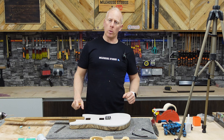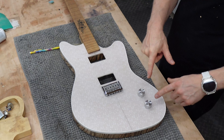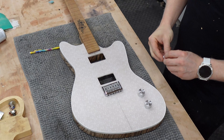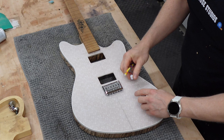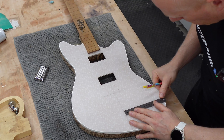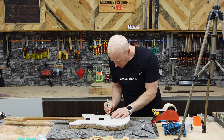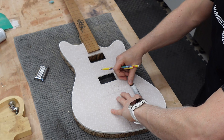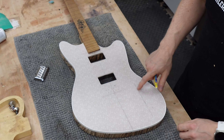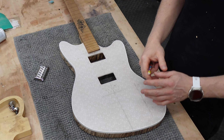I don't know what I'm gonna do with knobs, but we'll use them for the minute for positioning purposes. I'm gonna have a lever, so we're going kind of Telecaster-ish. That's good. I've got some marks. You don't have to fret about this sort of stuff — 90mm. We're gonna come over 90mm. Nice pencil line parallel with our centre line. Sometimes they look nice curved, but we're not gonna do that on this one. We're gonna go straight — I do like a straight control panel.